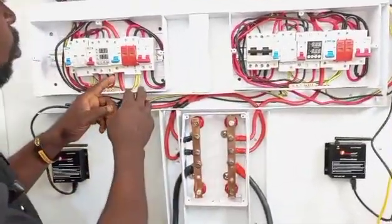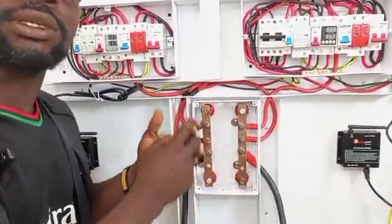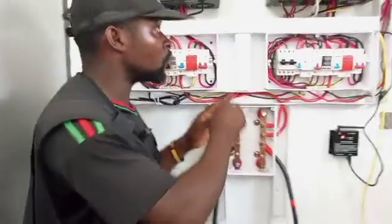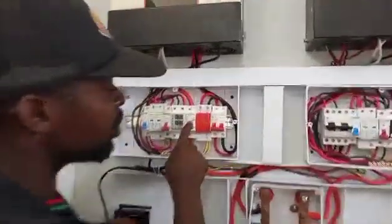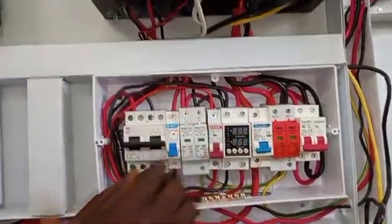While the positive — because you may need to, for emergency, break down your battery or your inverter — you just need to turn it off. We are using this one. All the positive: from this positive, you can see, we take it to this breaker, then from the top we send it down to the inverter. Likewise the same setting that we did here.